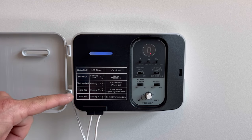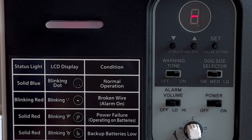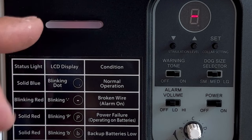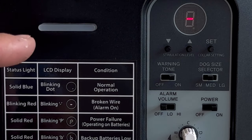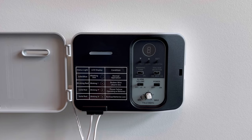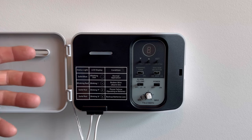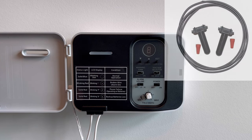But if the light ever changes to a blinking red and you have a flashing dash in the LCD screen, and you hear an audible alarm, it means the system's wire connection has been severed at some point. To get the alarm to shut off, you can simply switch the alarm volume to the off position. It will mute the alarm but will continue to flash red in the status light and flash a dash in the LCD screen, letting you know the system is still down and needs to be repaired. If the wire has been cut or damaged in the yard, you'll want to repair it properly — there is a repair kit link in the description below with everything you need to properly splice the fence system back together.